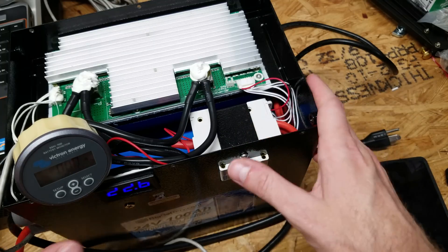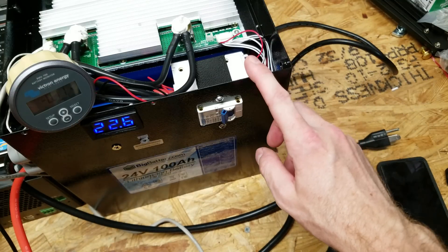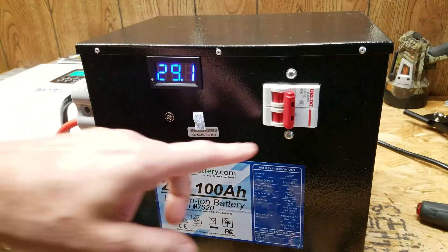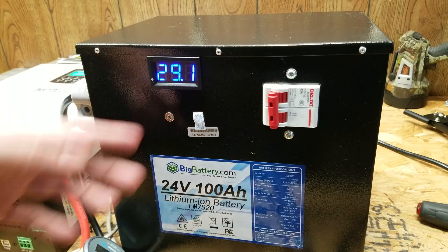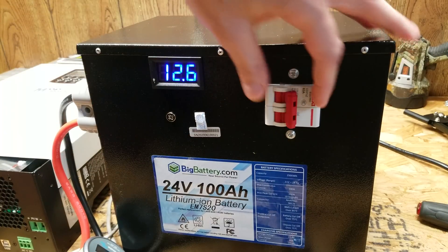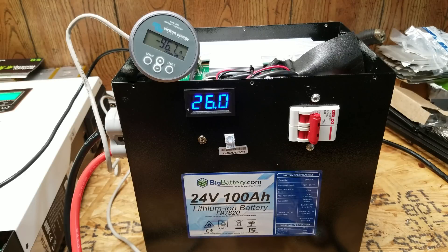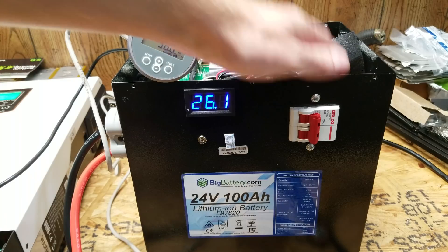To answer that question, I'm going to take the second battery and do the same test with the original breaker — and if it reaches the same temperatures, I'll tighten the bolts and then do it again to see if that changes things. I got the second battery charged up and when I went to shut it off, I noticed this circuit breaker gets stuck halfway — it sat in this position and did not fully disengage while the battery continued to operate. This is supposed to be a safety device. I flipped it and now it shuts off. So we started the test at 9:15 AM. After 15 minutes the breaker does not feel very warm at all — it feels normally warm, not excessively warm like before. Let's check it with a thermal camera.